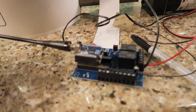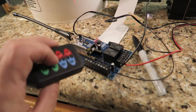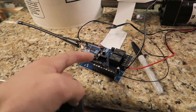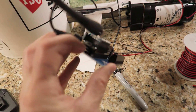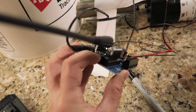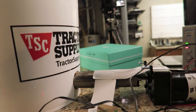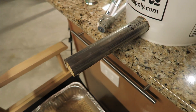Because this is tied into the Arduino, we'll be able to control it over Wi-Fi through software. What's happening now is the remote isn't talking directly to the relay — the remote talks to the Arduino, and the Arduino talks to the relay. Because this is a Particle Photon, I just flashed new software into it five minutes ago over Wi-Fi, and the breathing blue LED confirms we're connected to Wi-Fi.